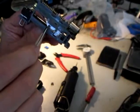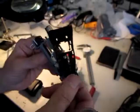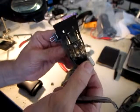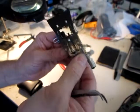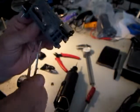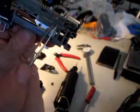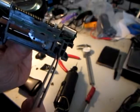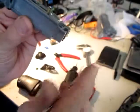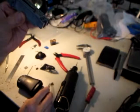The other brass piece and screw will be in this hole right here, and what that does is it holds this piece in place. So when this is in the home position it's down here, and then when it travels up about an inch and a half, it has to make the microswitch at the top. So I found a place right here — this little area that's kind of a square with a wall here and all the way around. The switch is going to lay right here, but below the level of this area right here.